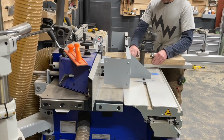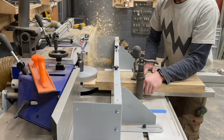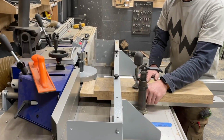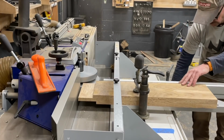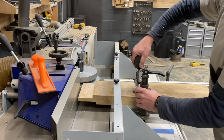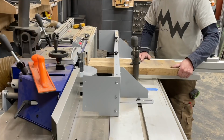Okay, so before the fire, I'd been talking to Whitehill about various cutter blocks. I will be doing an in-depth on these groovers here, which I'm using. It's going to give me a step tenon. What that's going to mean is that I can put my glazing units, or even a panel, one side, and still get my tenon the other in one go. They are amazing.